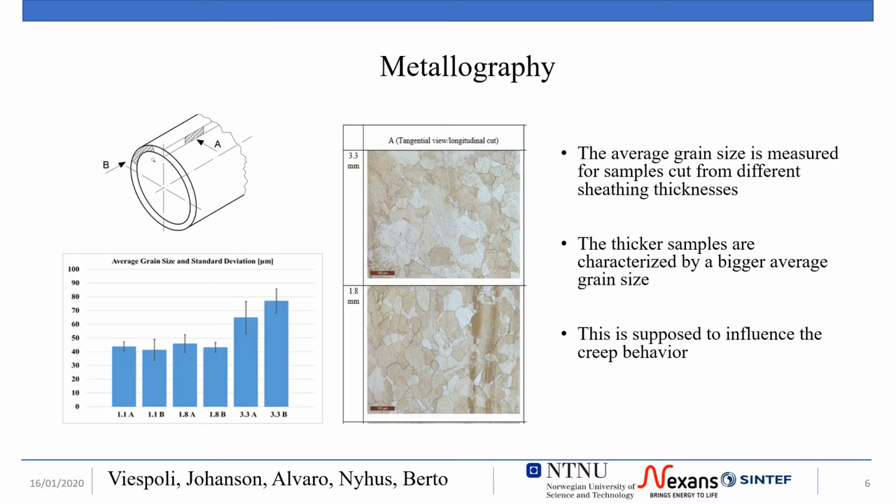The metallographic structure of the alloy has been observed in the radial and tangential plane for all the three extrusion thicknesses. In all cases, the difference of grain size due to the cutting plane chosen is not significant, nor do the grains look elongated in the extrusion direction. This should be due to the fact that room temperature is relatively high for lead, leading to recrystallization.